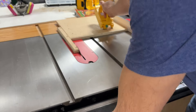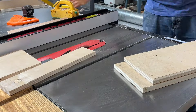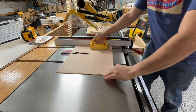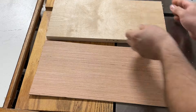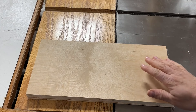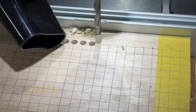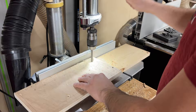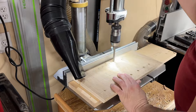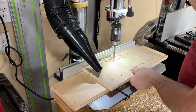We're going to start off by making the upper two drawer bit holders. We're going to get a piece of three quarter inch plywood, cut it to its length and to its width. We're going to readjust our fence and cut a quarter inch piece that's the exact same size for the bottom. The quarter inch piece is not going to have any holes in it — it simply catches the bits so they don't fall through the holes on the top piece. Next we're going to draw some lines three quarters of an inch apart and drill holes all the way through. This is going to take a lot of time and it's the most tedious part of the project, but it's the most important part because that's how we're going to keep all our bits stored and held.